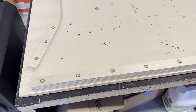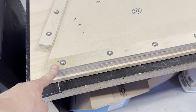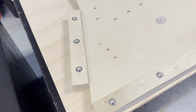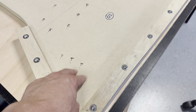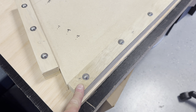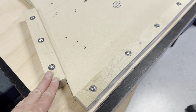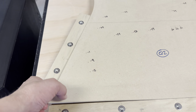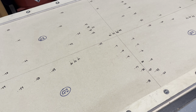Back to the jig for a minute — I realized something and doubled up on these pieces of wood. When my father does the zebra wood, he'll have a three-quarter-inch piece and use the quarter-inch piece on top as a gauge and jig to drill through. With these side pieces being only three-quarters of an inch tall, when he goes to put the quarter-inch on top it would slide around with nothing to hold it. So I doubled up these pieces to build the sides up, and it's a really good tight fit — that should be very precise as he lines things up.